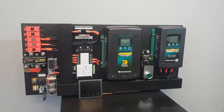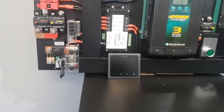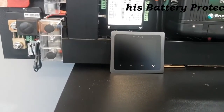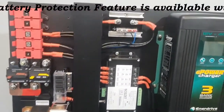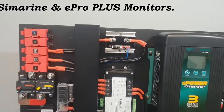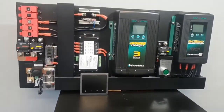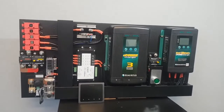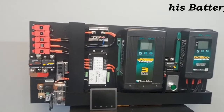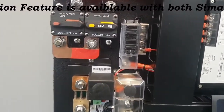Enerdrive has thought of everything with this system to ensure maximum longevity for your battery. The Symarine monitoring system has an alarm function — it is programmable, and you as the user can adjust it to suit your needs. It's wired to a relay or switching device here. If you require your system to disconnect loads at 50% for lead-acid batteries, you can do it via Symarine. If you prefer it to switch off at 20% state of charge for a BTEC lithium or any other lithium system, you can do it via this system as well.